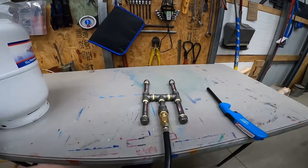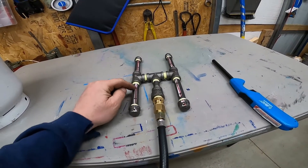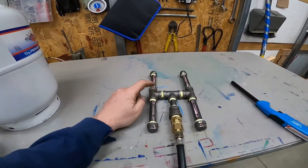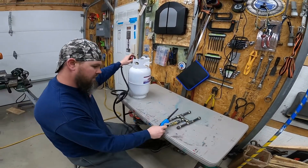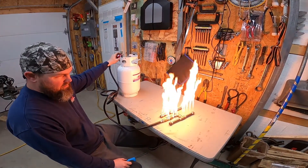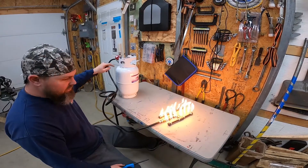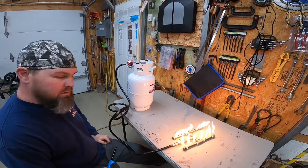I got this thing all together. I drilled 1/8-inch holes, started from the outside, inch and a half in. I ground a little flat spot to make it a little easier to do the holes, and put them at an angle so they're kind of facing in. I drilled one in each tee and one in each cap. The hose is a 0 to 20 PSI pressure hose so I can adjust it down. We'll get it in the box and see how it works.